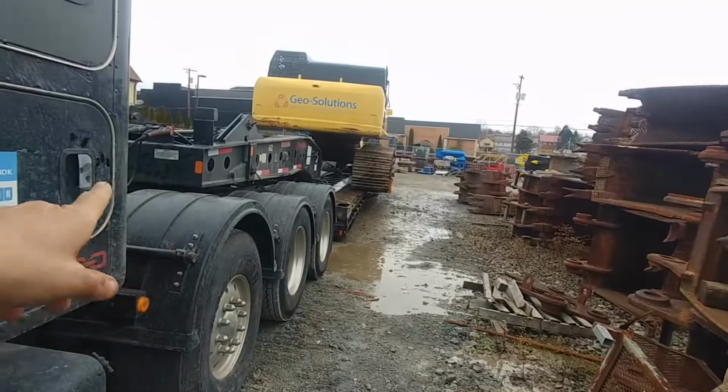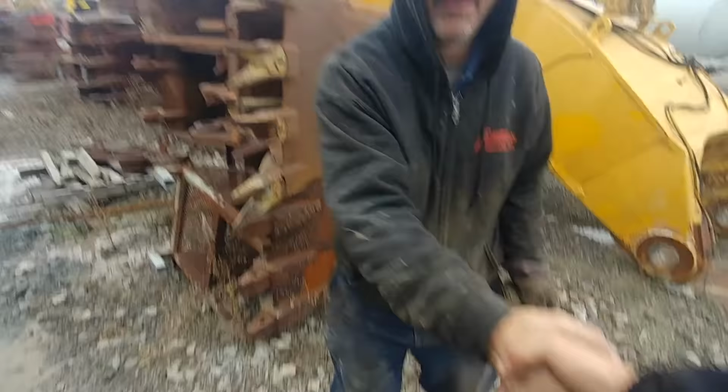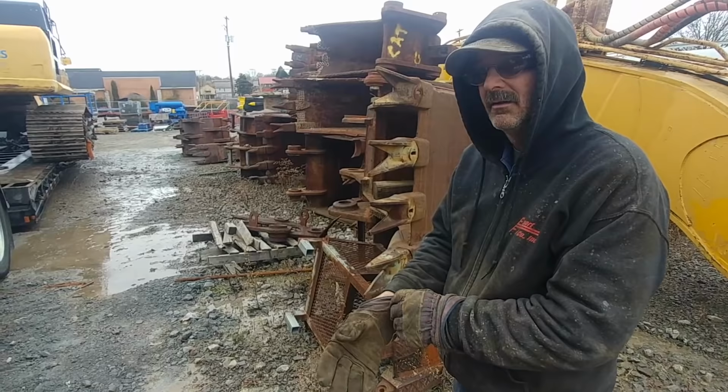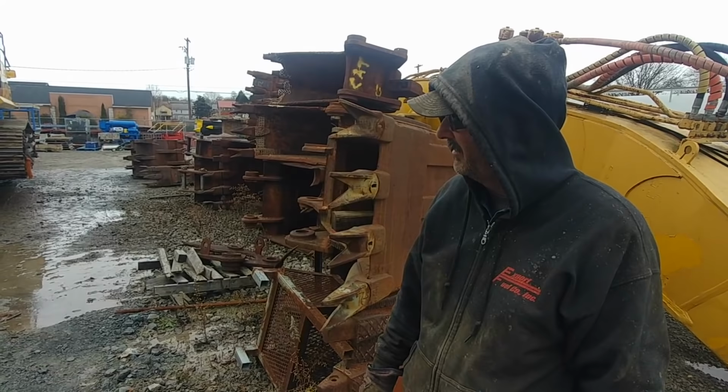Well, the machine is loaded, and this is the feller operator, Dave, who loaded this. So, Dave, thank you very much. We wanted to ask you a couple of questions for our YouTube viewers. Like, what was challenging about loading such a wide, 12-foot wide machine? The biggest thing is not to rely just on your ramps. Add timbers in front to take the grade out.